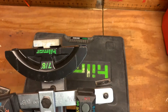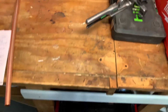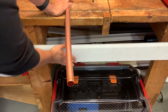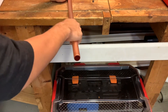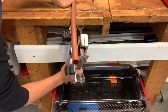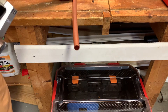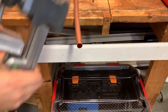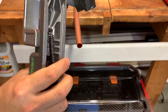Let me show you the reverse bending attachment in action and why you would need it. Let's say you want to do a bend but you need to go down, and the copper is obviously attached over here — you can't just move it, bend it, and put it back. Your copper is attached, so there's no way to make that bend regularly because your bender will end up hitting you and won't allow a complete bend. The only other way would be cutting a piece off, putting a 90-degree fitting on, and soldering — but nobody wants to do all that extra work. So what do you do? You get a reverse bender.